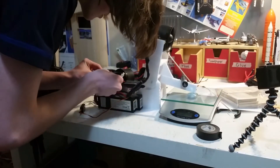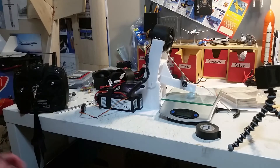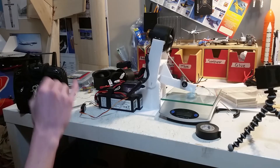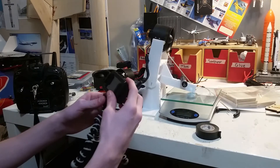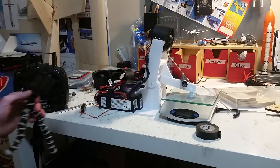So those two wires are in. Now I'm going to put in the jumper - it's going to be a spark again. This motor is going to be spinning at roughly 40,000 RPM. I have not balanced this rotor - I probably should have - but they seem to be pretty well balanced from the factory. But just as a precaution, I'm going to stay out of the disc area of this when it's actually firing. I'm going to be probably back in the corner of my room. I'm going to have this camera set up to monitor the RPMs and such.